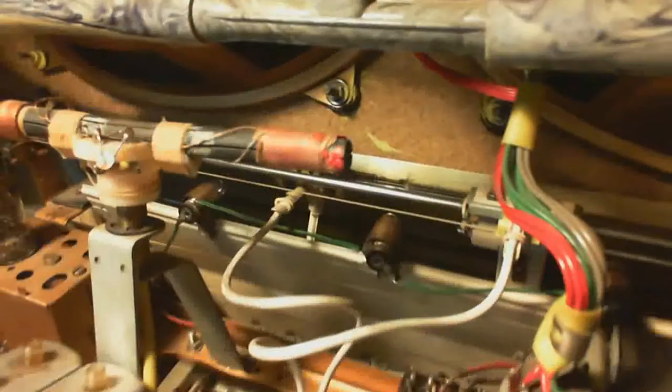So that's a little odd, what they're doing with these lights on the front panel. Not normally are they in series. Normally they come off the big power transformer, all hooked up in parallel on a 6.3 volt heater line for tubes. That's the usual thing. So that's a little strange too. I don't like it. Somebody's been in here and done a lot of stuff to this set. That's what it looks like to me.